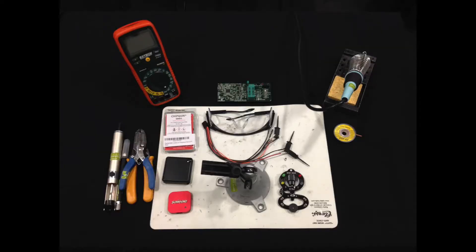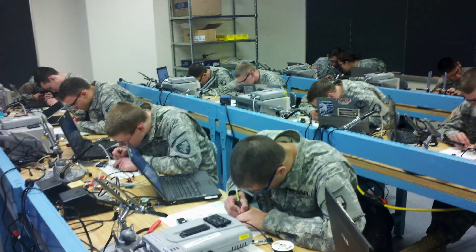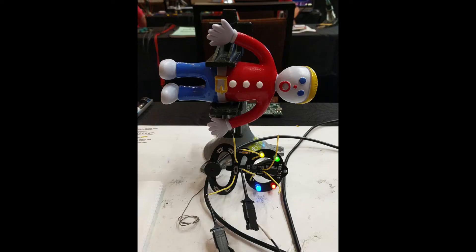I update it to keep up with new attacks and new techniques. In this class I try to cover a comprehensive view of attacking hardware, including product teardown, component identification, circuit board reverse engineering, signal monitoring and analysis, and memory extraction.